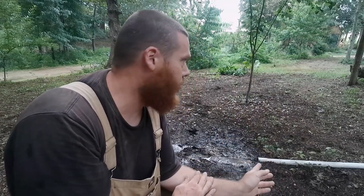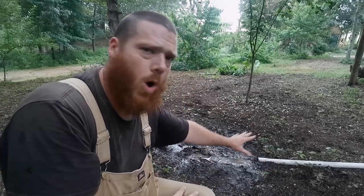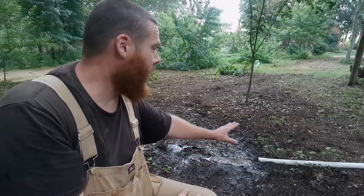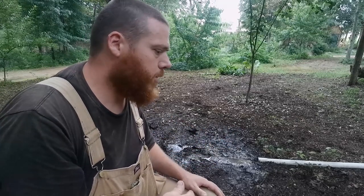It won't stink but you do have to make sure to take it out and put it in an area where you want to keep it permanently. We have a septic tank for our black water, but here is our gray water that comes from our sink — our house is just out of frame over there. Pretty much just our kitchen sink drains out here. If you use mild detergents and don't put anything very harsh down it, then it's okay. All this water comes down here, keeps it really moist, and it doesn't stink at all — it helps water the garden, and if it does start stinking I'll just put some more mulch on here.